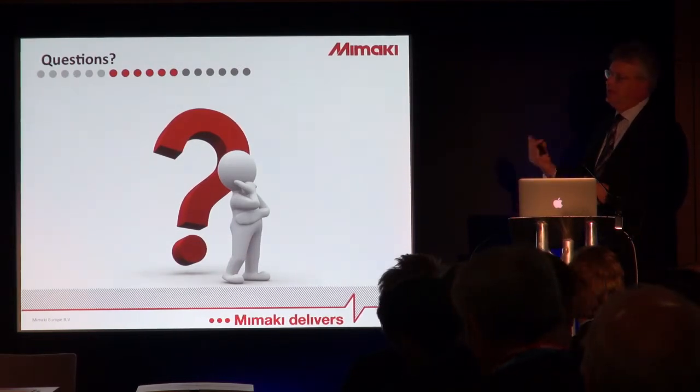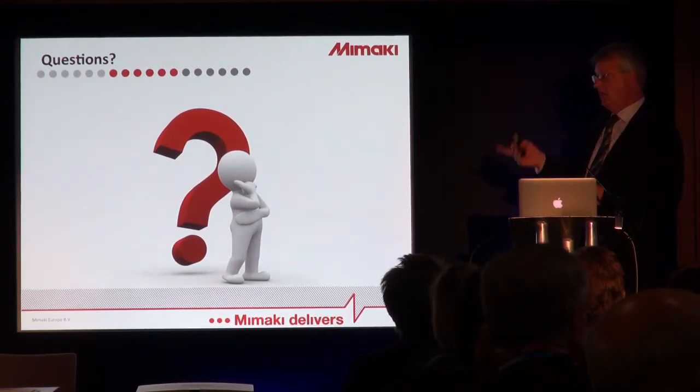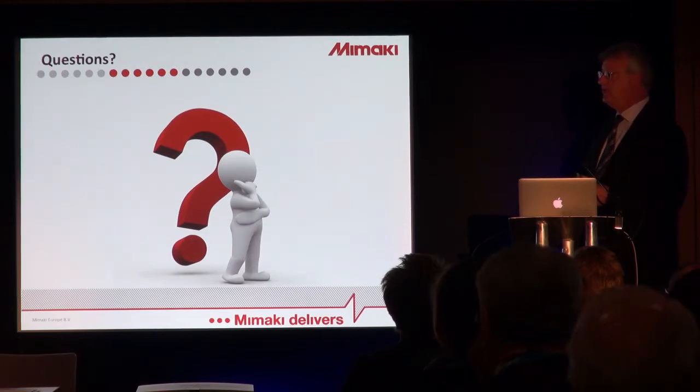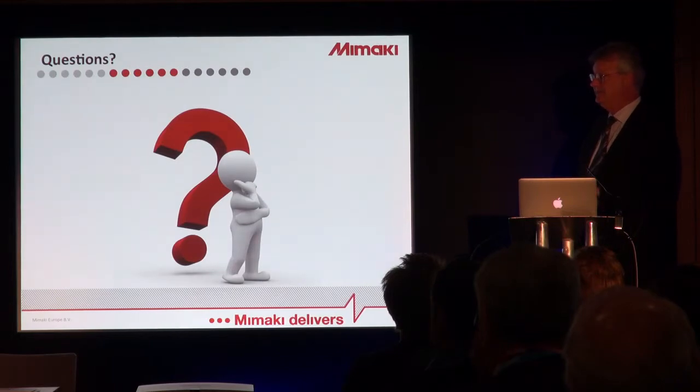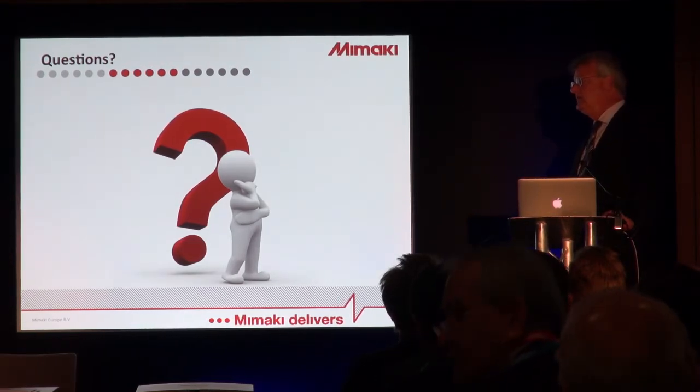So you need to wash the machine, especially with white, because it has a white circulation system inside, where you need to recirculate the white, and once white is in there, it will take some effort to clean it out. But it is possible to clean out. There is a flushing possibility. You start, say, with CMYK, and then you want the other colours, you can. You can, but you need to flush it. There is a procedure for it. Okay. But it is possible.